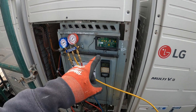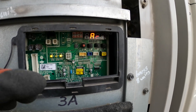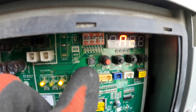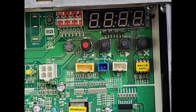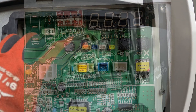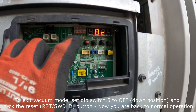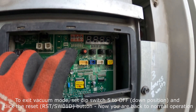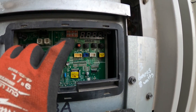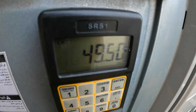It's all about these settings. There's also a fifth button we haven't talked about — that's actually going to be a reset; on top it says RST. To get out of vacuum mode, you can click reset. But also make sure you put that dip switch number 5 down into the off position. Or you can just put it into off position and cycle the power, and it's pretty much going to do the same thing.